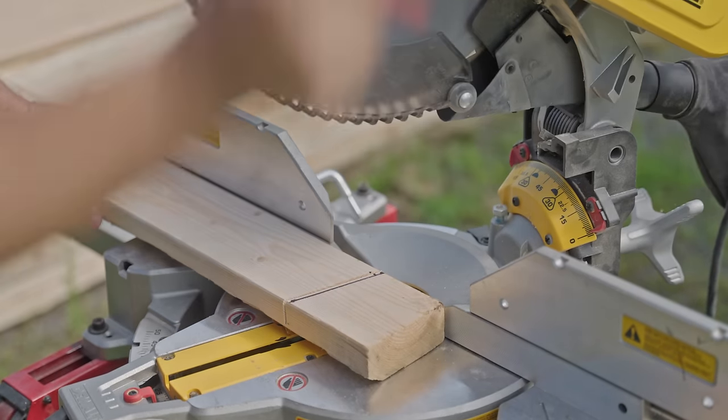Okay. And then, oh, 10 burr. Okay, that's out of the way. It's a fresh air intake vent. This is passive. There's no motor, there's nothing. But because the wind comes from across that field almost every day, this is a great way to get air circulation in the shed, okay? So eventually we'll be putting it right here. The challenge is I need to actually attach it to something. So I'm going to add some blocking so I've got a nailing surface, okay? All right.